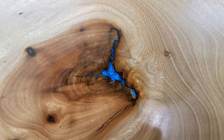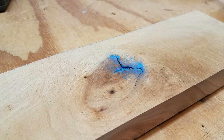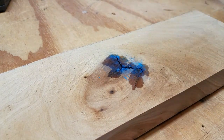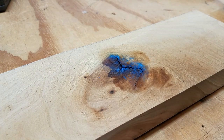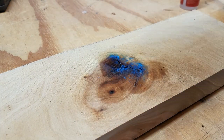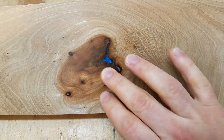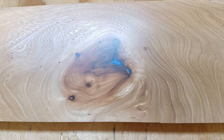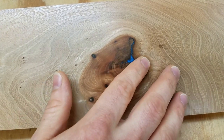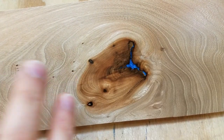This was my second attempt, where I tried a different technique. I took the mica powder and sprinkled it on the bottom of the knot hole where I wanted it, then used thin CA glue to set it in place — just set that powder on the bottom without mixing any more powder in. Then I used the thick Gap Filler on top of that. I think this is a better approach: it gives you a lot of depth while keeping the bright, vivid colors. My favorite thing about these CA glues is salvaging boards like this — look at the grain on this thing, it's absolutely stunning. It was interrupted by a crumbly, unusable knot, but by filling it in and making it a feature piece instead of an eyesore, it's added so much more character to an already visually stunning board.